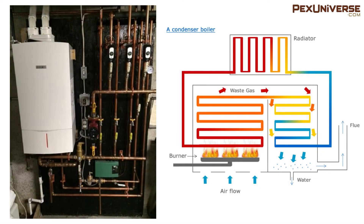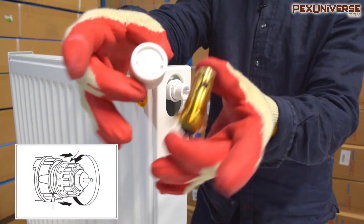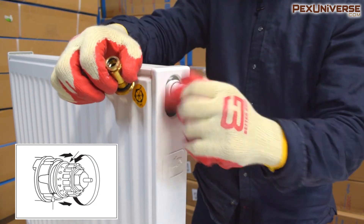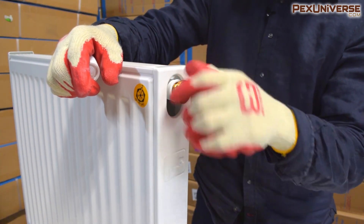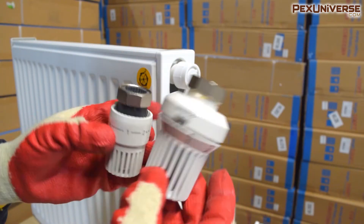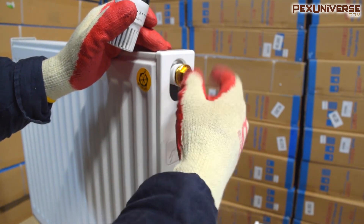It's recommended to run these radiators at reduced temperatures. When using a condensing boiler, the system should be designed so that the return water temperature makes the boiler condense except on the coldest days of the year. Each radiator comes with a flow center valve mounted on the same side as the water connections. This valve consists of two-part integral components for temperature control and flow balancing — all you do is take out the plug that comes in the radiator and insert the flow valve.